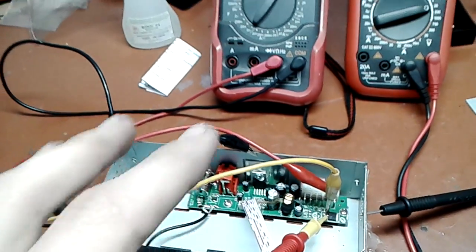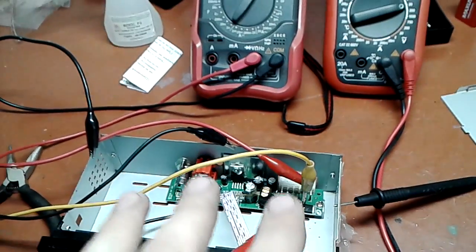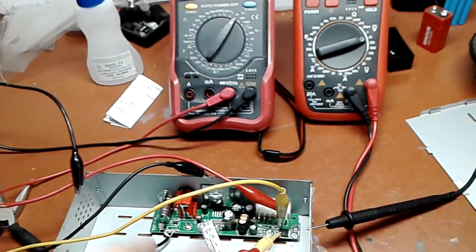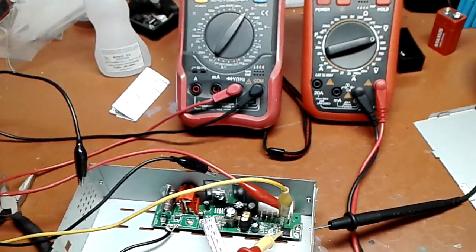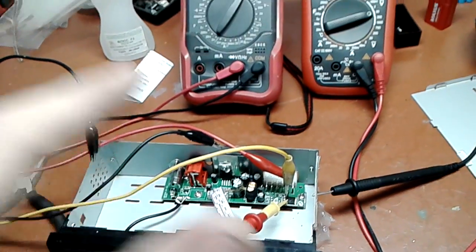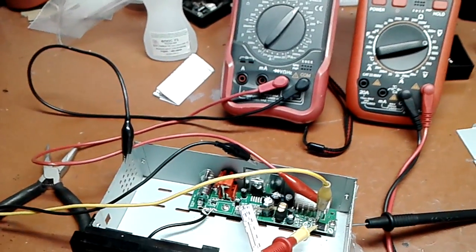Unfortunately, it is burnt so well that I cannot read the marking on it. But basically I'm gonna replace that resistor with a 0 ohm jumper link. It will be alright. The purpose of that resistor, well, I think it was there to be a fusible link. So in case an excess current is flowing through the chain, it will burn open, which it successfully did.